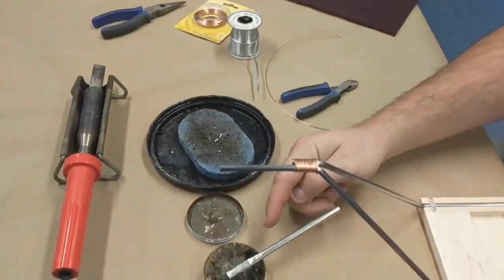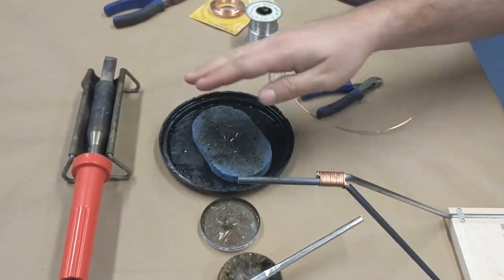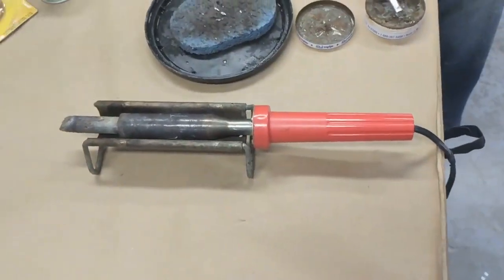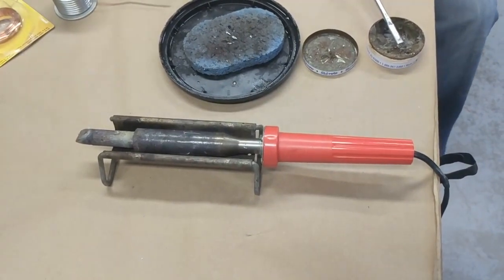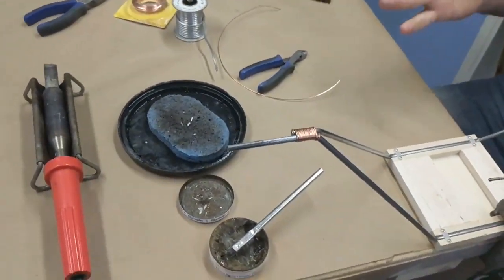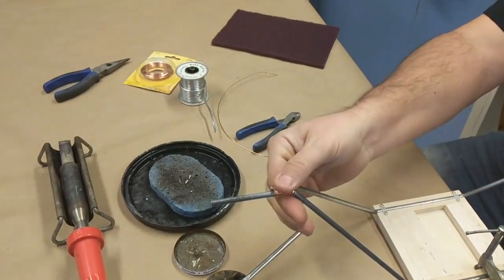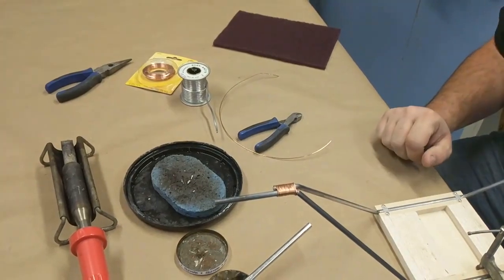You want a good flux, a wet sponge for cleaning off the tip of your iron, and the iron is the key thing. You need to have a decent-sized, big iron. This is a 175 watt iron. You can get them right around $55 — as of today they're running $55, it's not a bad price. The advantage of the 175 watt iron is you're going to get a big 5/8 inch chisel tip, and that's going to hold the heat and transfer it into the wire so that it melts properly and gets warm enough. Otherwise you're going to end up with cold solder joints.